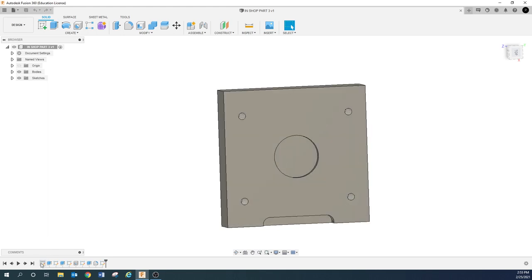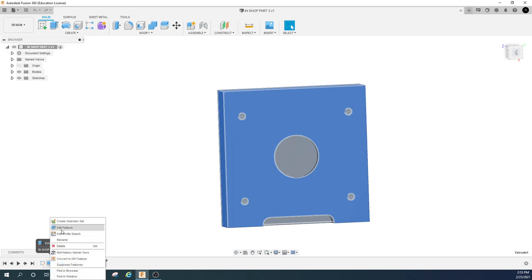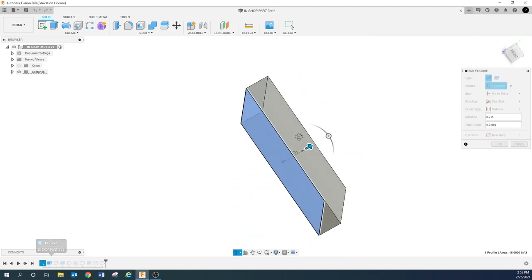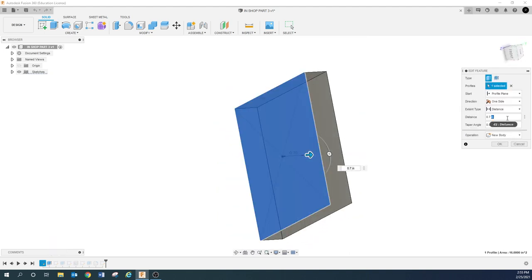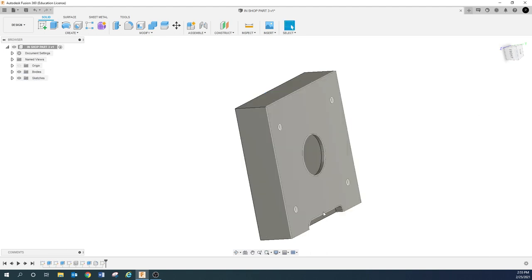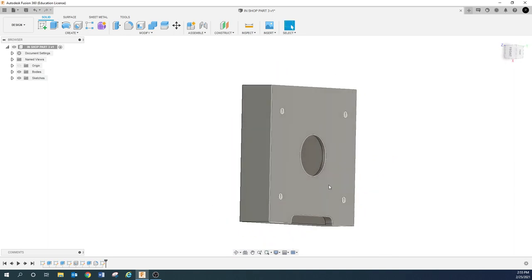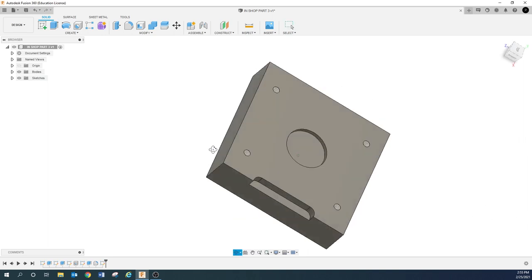So right here in this sketch, that was our initial sketch we did. This was our initial extrusion. So I'm going to go Edit Feature. I set mine to be 700 thick. No, let's just say that yours is 1 inch thick. Obviously, you would need to change that. Everything else is fine because everything else was driven off the top here. So when you update that, everything should still jive, if you drew it correctly.